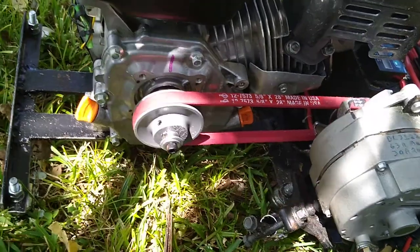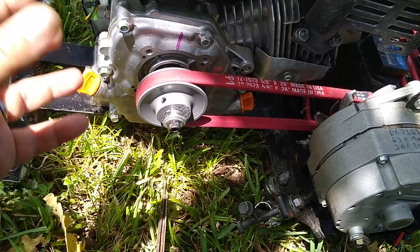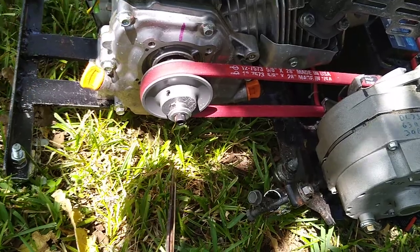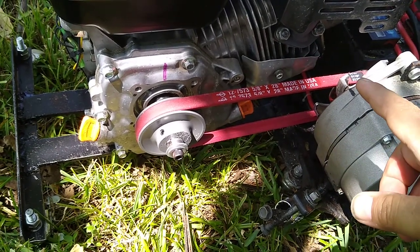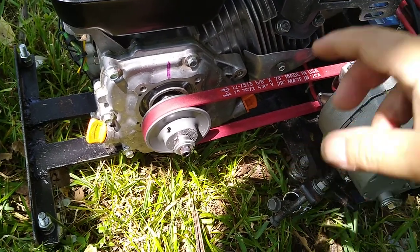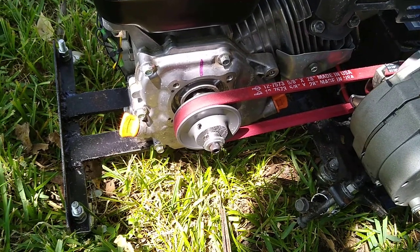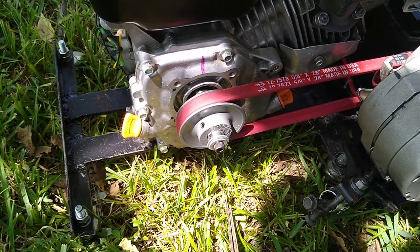When you build this thing up and you put the aluminum billet flywheel on, you adjust the magneto, because that new flywheel has so much stronger magnets that they'll basically burn up your magneto. You have to get the magneto a little bit further away. And then you update the camshaft, and then you end up having to adjust the valves again. But you've got a performance cam, performance push rods, performance connecting rod, performance rocker arms, your performance flywheel, and performance upgrades to your carburetor, which you have to do when you do your whole engine setup.